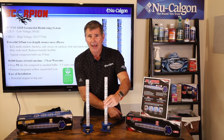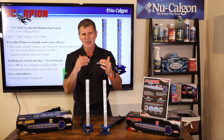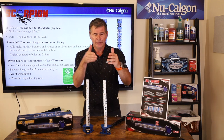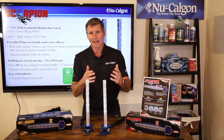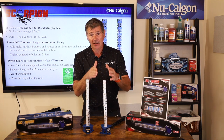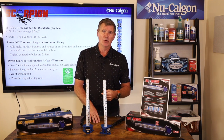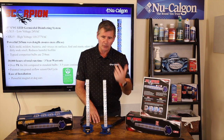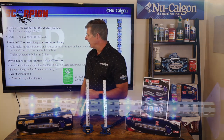When you look at the EPA's average runtime for an air handler in America, you're looking at just under 3,000 hours per year. With a 30,000-hour device, you're looking at nearly up to 10 years of service life. And there's no fancy wiring — no need to run jumpers over to the G terminal on your air handler. The airflow sensor handles all of that for you.